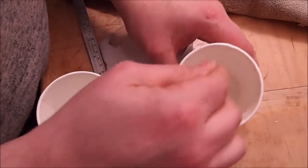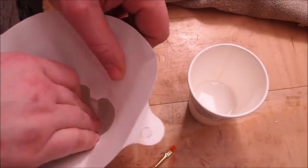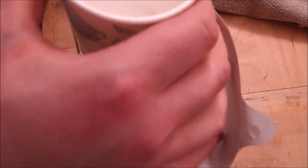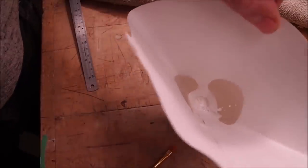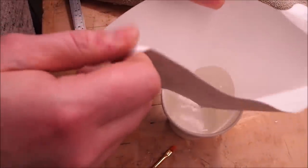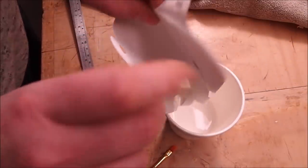I've got about a teaspoon in some water here. You don't want to get this stuff on your hands for any length of time and certainly don't want to breathe it in — it's really bad to breathe in. Usual safety precautions. Now pure oxalic acid will dissolve completely, but this being a cleanser I think it's got some scouring material and other minerals in there too, so I'm just going to filter it through a paint filter to be on the safe side. I intend to clean the surface off after it's been treated.